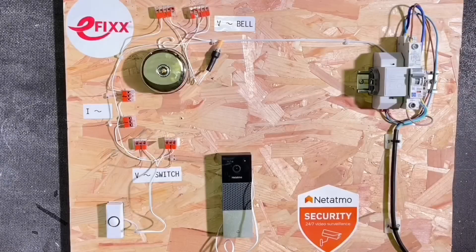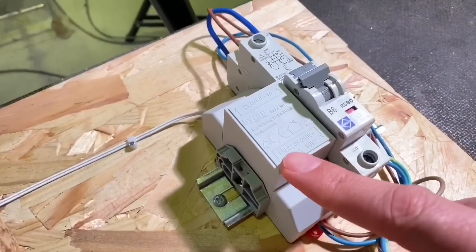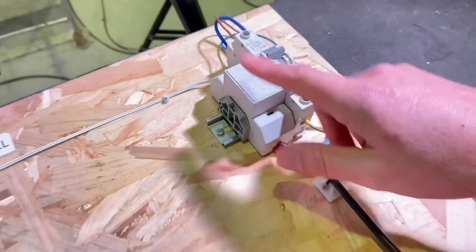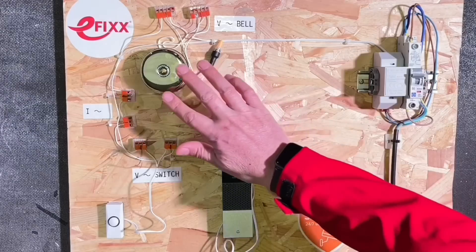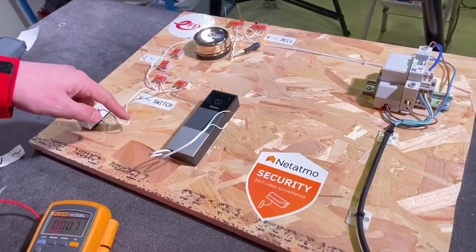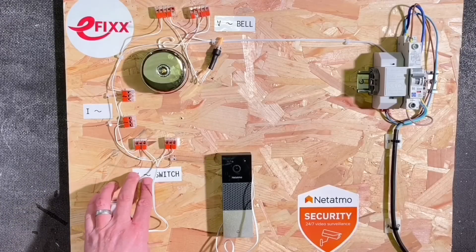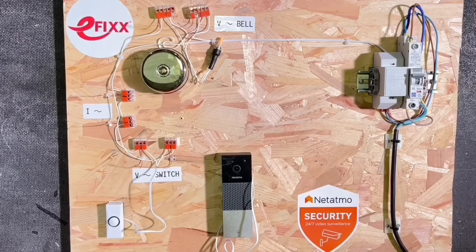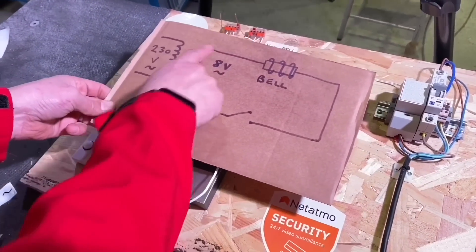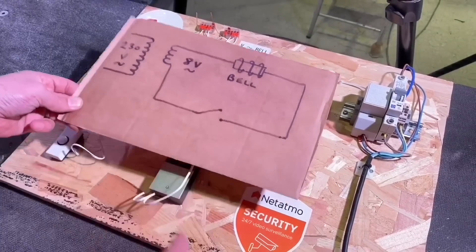Shall we take a closer look? So here's what we'll have in a typical consumer unit: we've got our bell transformer fed by an MCB, 230 volts on the primary side and 8 volts rated at 1 amp on the secondary side. That feeds along to our bell — we've added a lamp as well, we'll come to that in a minute — and then down to our switch. You've also got a couple of test points there for measuring both the current and voltage across the switch, as well as the voltage across the bell. Just so we can see how this setup works and compare and contrast. Here's my schematic — it really is a simple circuit: out from the transformer, down to the bell, down to the switch. The very simplest circuit almost possible.